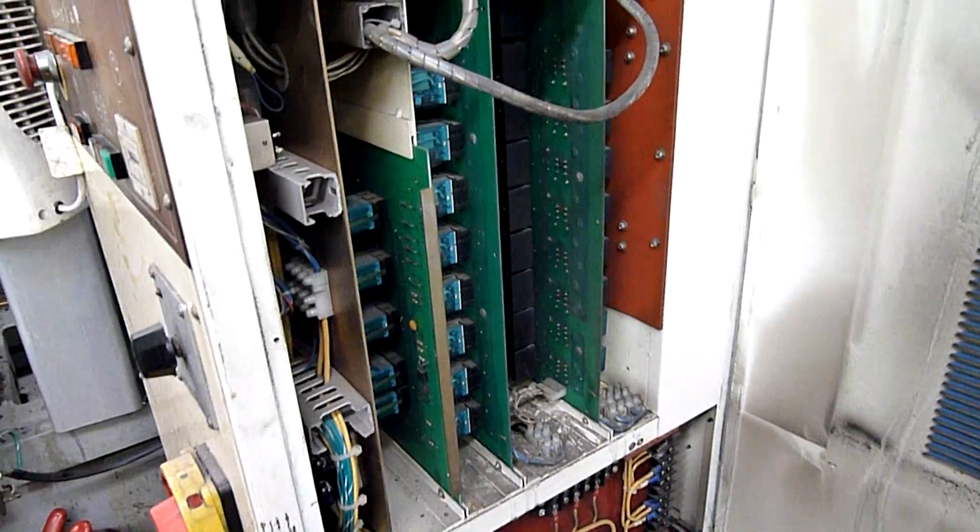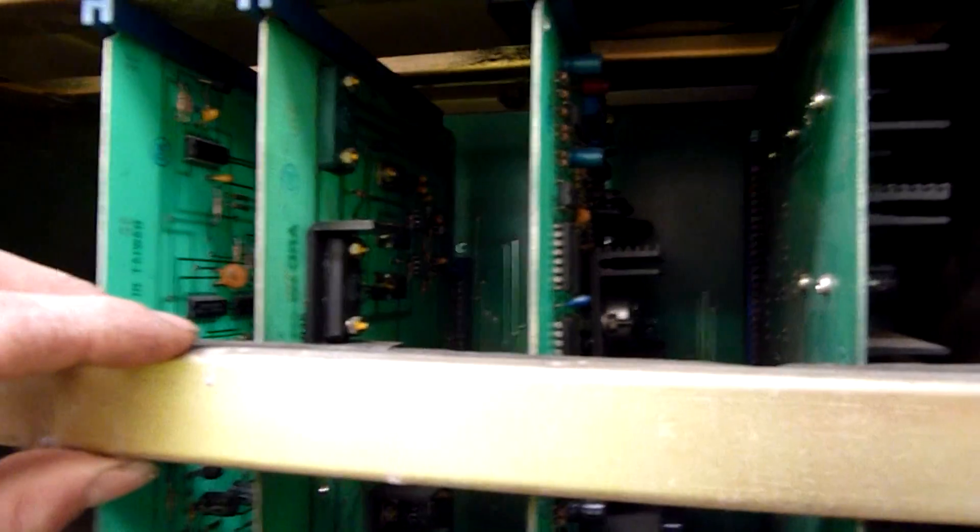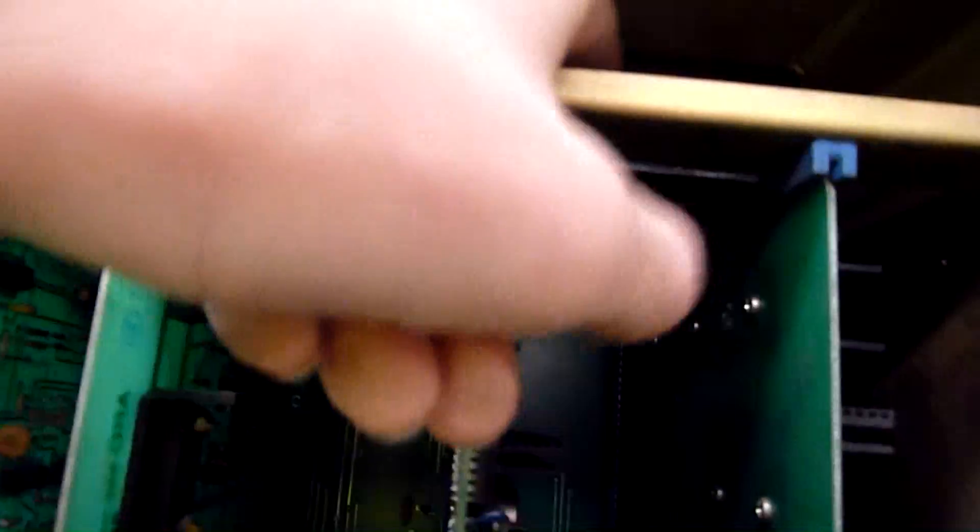Let's have a look inside. It's all fairly old gear — it's all relay logic, a lot of relays, and a lot of power transistors. This will be the main power output stage. Pulse generation and everything will be done up here I think. There are various large power modules. When we got it this fan had failed and these transistors were so hot you could cook an egg on them. It was causing stability issues, but since replacing that fan this thing is absolute gold — it runs perfectly.